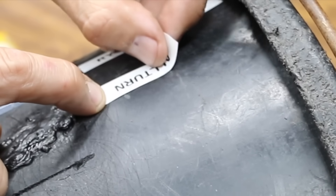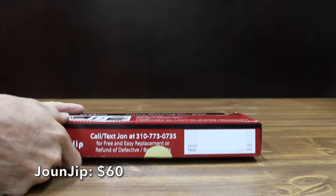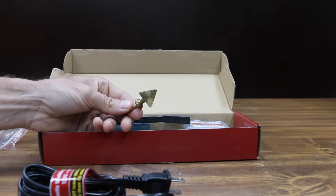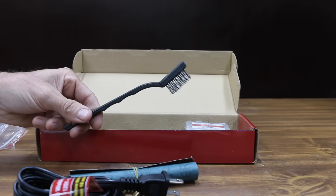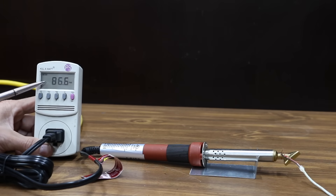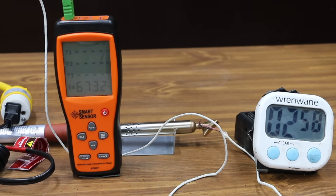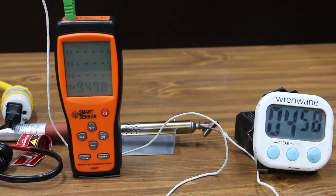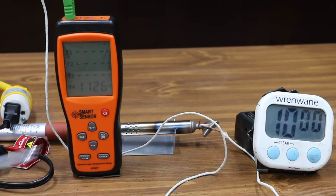At a price of $60 is this June Jip Plastic Welding Kit. The kit includes a plastic welding iron, two welding tips, 20 welding rods, one sandpaper, two stainless steel wire mesh, one wire brush, and one welder stand. The June Jip is made in China and is very close to the same wattage as the RX Weld at 87 watts. However, the June Jip warms up a lot faster — it's 200 degrees warmer than the RX Weld at three minutes, reaching 680 degrees Fahrenheit. At five minutes it's at 953 degrees, and it reached a maximum temperature of 1,126 degrees after ten minutes.